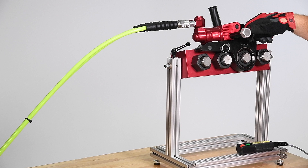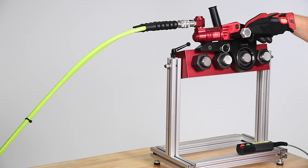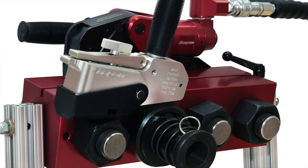Using the removable handle, place the wrench on the fastener with the reaction arm against the solid blocking surface. In this case, we're using the adjacent fastener. The reaction arm is a pinch point, so be sure to keep hands and fingers away from this area by using the handle to steady the wrench. You may need a backup wrench to keep the counter nut from turning. In this case, a hydraulic BTQ wrench is being used.